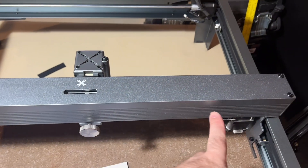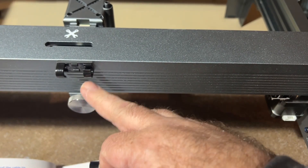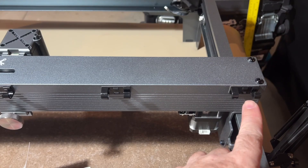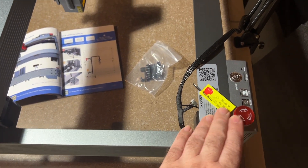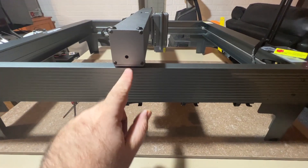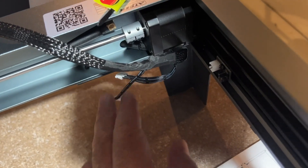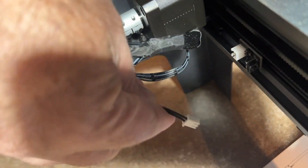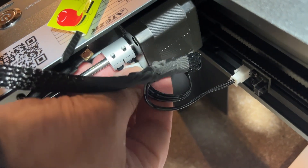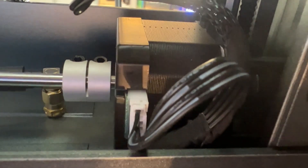For step seven, we're going to install three cable ties on the back of the X-axis. To install these, you just need to remove the VHB tape backing on the back and stick them on. I've got all three installed on the X-axis now. This smaller two-pin connector is going to go right into here, which I believe is a limit switch so it knows how far it can go back. And this connector is going to go into the motor. You can see how the motor connects — this just goes into here and there's only a certain way it can go in. Make sure it's firmly seated, not loose at all.